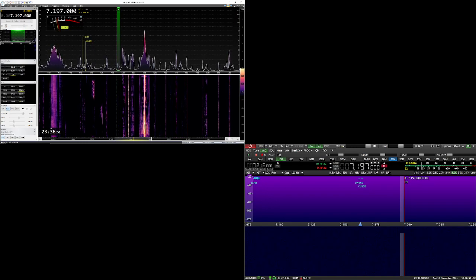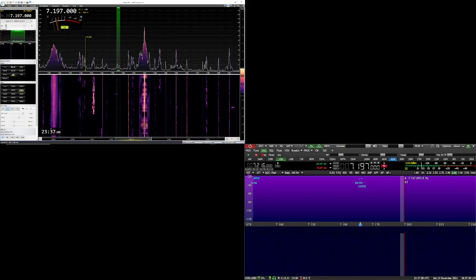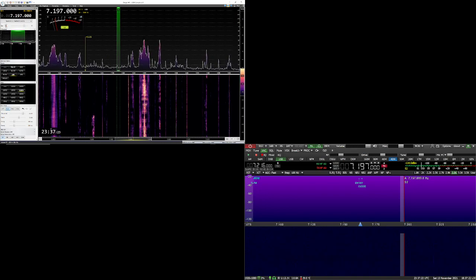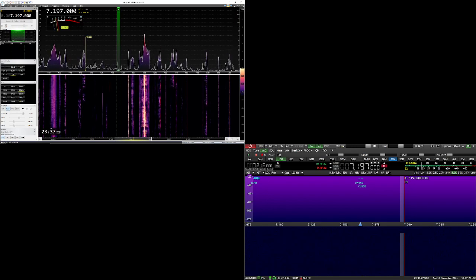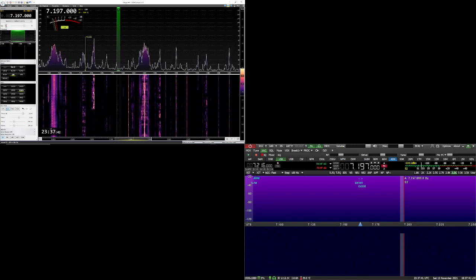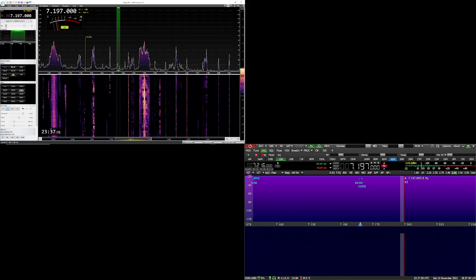I was on 40 meters today, and this video will be linked to the website — there'll be a link in the description. On the 7300 page there's information on how I'm getting TX audio into the rig. I've since moved into a full-blown DAW, with all TX audio piped into the rig via USB audio codec, all virtually using the DAW. There's a tutorial video on my YouTube channel. I was chatting with some guys, and one of them told me that if he heard me with his eyes closed and wasn't looking at the pan adapter, he would swear I was running four kilohertz wide — and this is on the 7300.